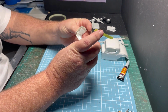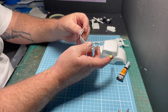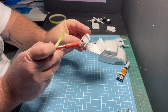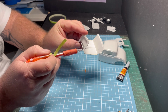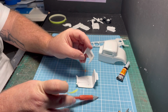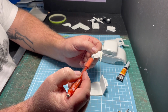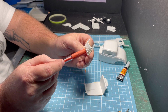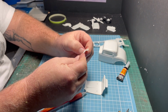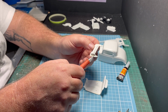So with the firewall, it now sits too high. Like the floor pan comes up against the firewall too high. So we have to take, I'll get my pointer, we have to take the 6mm out of there and out of these sections here and off the ends of these here. So basically we're moving this line here up 6mm. I have already drawn it on the back because I got confused a second ago, so I had to work it out again. So where I've marked here and down the sides here, on that edge, that all has to come out. This one's been glued in before, so don't mind all the glue and crap on there. I think these little lugs have to be removed as well.